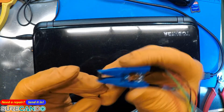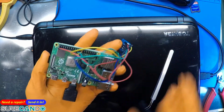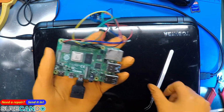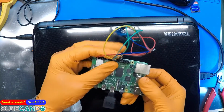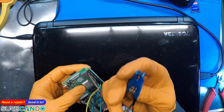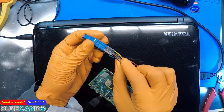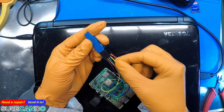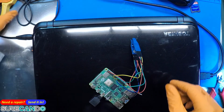Okay. If you put it the wrong way, you'll notice the Raspberry Pi will have power issues or turn off because you're basically grounding the 3.3 volt. Yeah, you'll damage something. That's pretty much it here. How to put the chip in. So black pin, pin number 4. Yellow is where the dot is. Alright, now let's plug this in now.